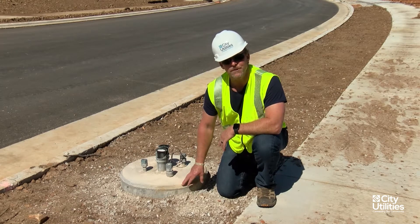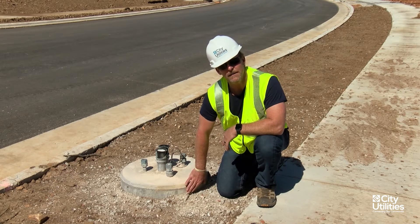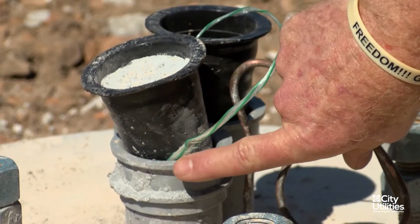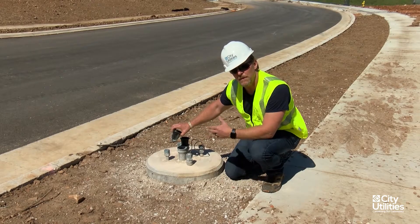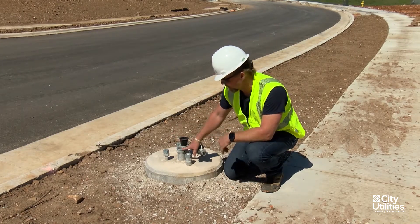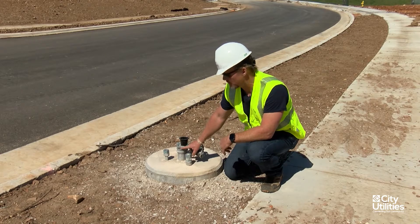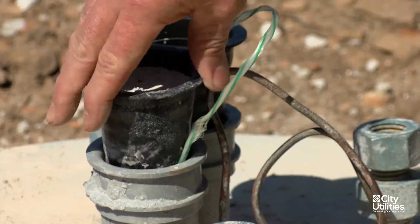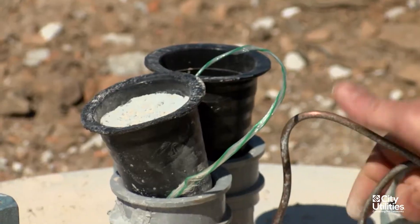He used a 24-inch sonotube, six foot long, in the ground, and then removed the sonotube just slightly above grade so that the sonotube is no longer exposed. I also want to point out that there is to be string blown in every location — it may go from here to the transformer location, or from here to a secondary pedestal; it just depends on what's been called out. We also have our bell end that's installed, so be sure and put enough distance between your radiuses to be able to install these properly. These have to be installed to make wire pulling much easier. You'll also be able to see our copper and how much of it we use in the next few shots.